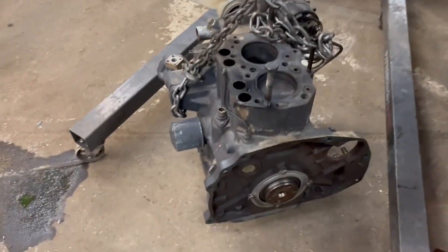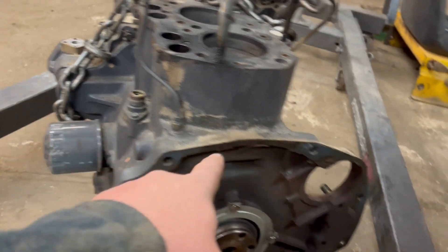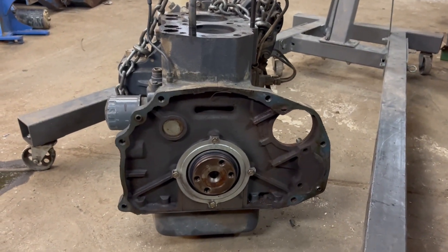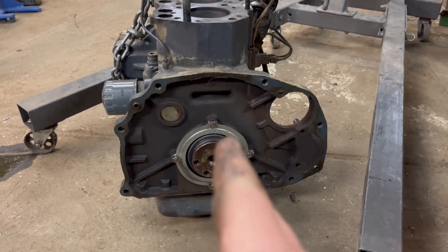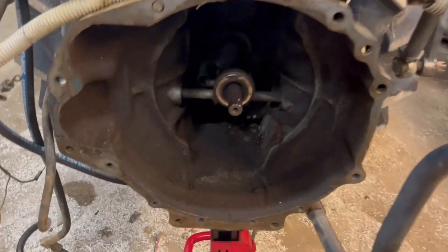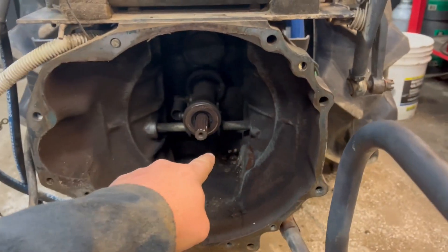Let's get back to what we're here for. This is the engine that came out of the tractor. If you notice the clutch housing — this is molded into the engine block, so it can't be removed. Looking at this engine from the crankshaft end, from the driver's perspective, on this original engine the starter is on the right. That's where the starter did go — right there. And on the machine, this is the bell housing; the clutch sits in here, and this is the little starter bump that makes room for the front end of the starter. The flywheel spins in here and the clutch is on the other side.